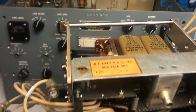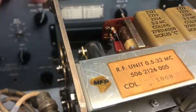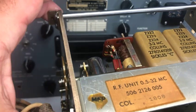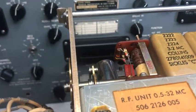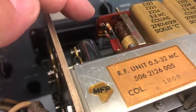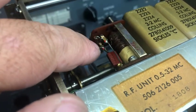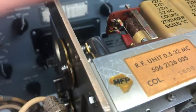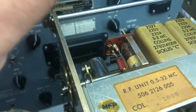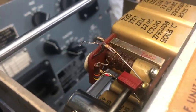While I was in the process of reassembly and making thousands of tests, this trimmer capacitor stopped regulating. It's a typical failure of this kind of ceramic capacitor — I've also found these in the Tektronix oscilloscope and in the receiver R388. I'm going to remove it. I have to remove all the solder joints here, remove the capacitor, and repair the rubber shim that is between the two ceramic layers.